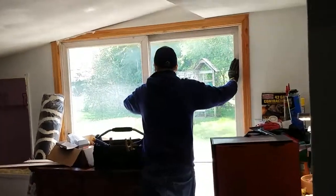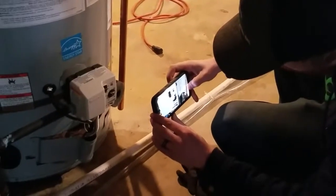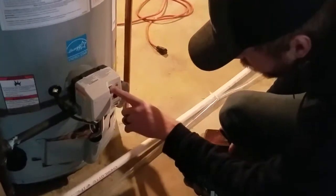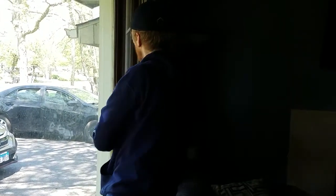Make sure you prep the home too: turn off the furnace, close all windows, put the water heater in standby mode, and make sure that the fireplace flue is closed so we're protected against any ash from pulling into the house.